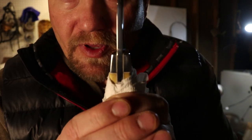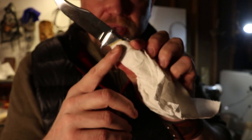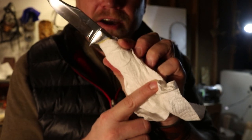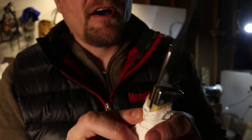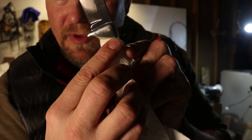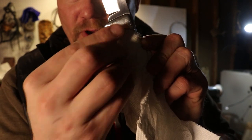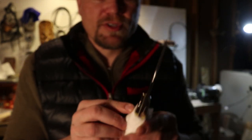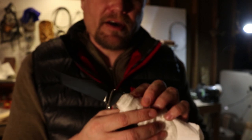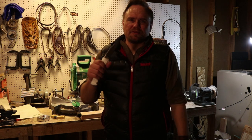And then also, if you look back here, these back bolsters aren't lined up perfectly, and that caused everything to basically cascade out of line down the knife and cost me endless hours of work to try to get everything lined up after this. I basically took pieces of sandpaper and put them in between each section of the knife, like the bolsters and the scales and the front bolsters, and sat there and sanded them against each other to form fit them to each other. I think it worked. Everything is tight and mostly aligned except for these front bolsters, but yeah. All right, let's go get the rest of this handle material fitted up and glued to the tang.